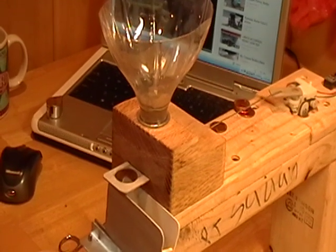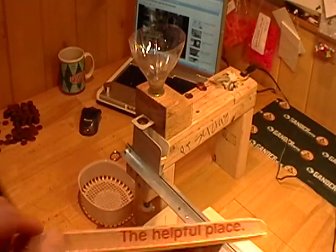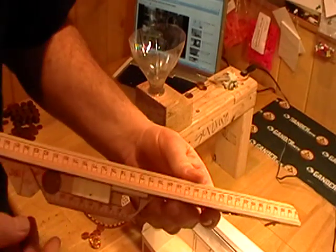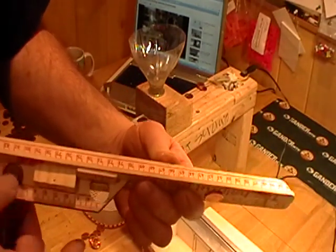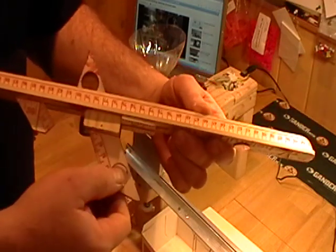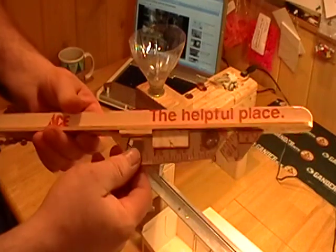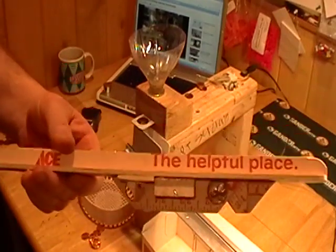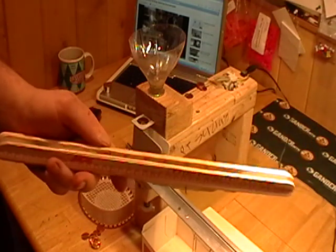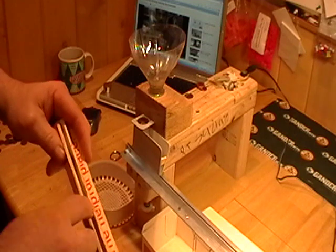And voila — now you've got a little penny dispenser. I'm going to back up and show you the original design. What I designed was this: a penny would roll down the chute, and I've got this little bar here with a penny in it, which is weighted to the old style heavy copper penny. It was supposed to allow the pennies to fall out or ride through. But what I found was it's actually more reliable if you go backwards, which seems quite unorthodox. The problem was this crude first attempt was just too wide, too messy — parts flopped around, pennies would get jammed in here.